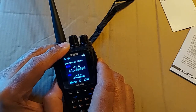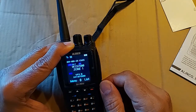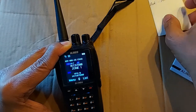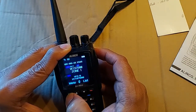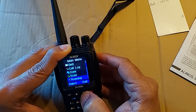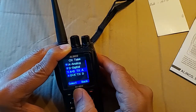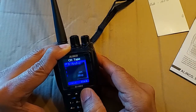I'll switch it to channel mode now and pick channel 7 as it is right now. Instead of adding a new channel, I'll just modify channel 7 with the frequencies for my repeater. With channel 7 as the selected main channel, let's go into menu. There are a lot more settings now that we're in a digital mode on that channel. Go to settings, channel set. The first thing I have to do is make this an analog channel, and that changes the menu settings that you see.